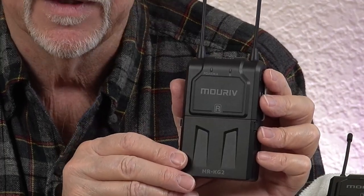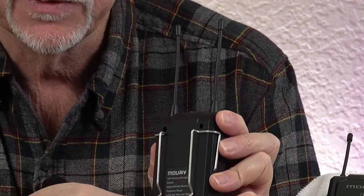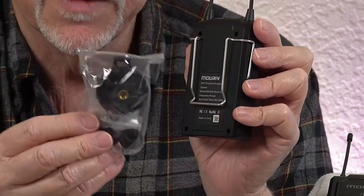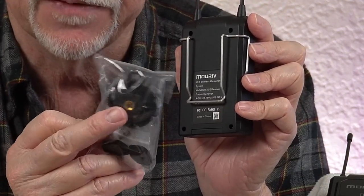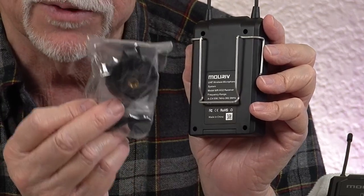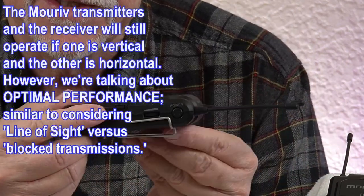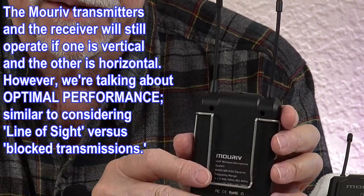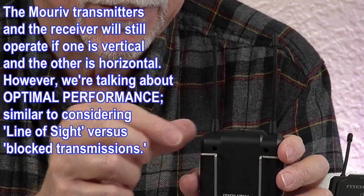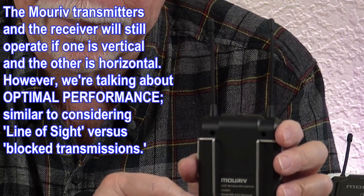And here is the receiver — dual antenna, two antennas — and all of the units on the back have a belt clip. The antenna is going to be in a horizontal position; let me show it to you. This looks like a cold shoe mount, but actually this device in the back latches onto the belt clip and will allow you to mount your receiver to a cold shoe mount. The only thing I haven't figured out yet is that if you do that, the antennas are going to be in a horizontal position, not vertical. Antenna theory says that if you're transmitting in a vertical pattern from the transmitters, the receiver should be vertical. So I'm going to have to think about maybe an L bracket if I were to use the adapter for the belt clips.